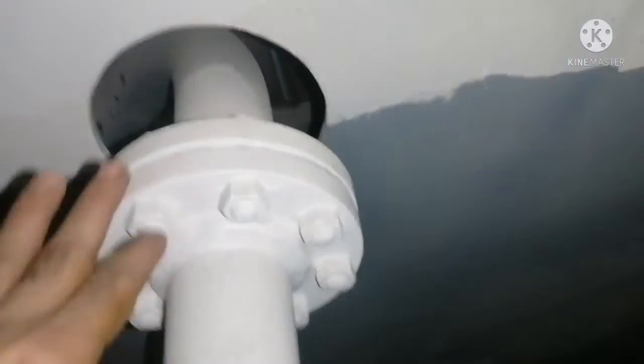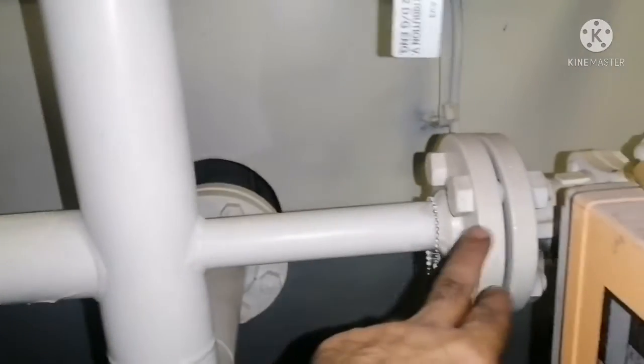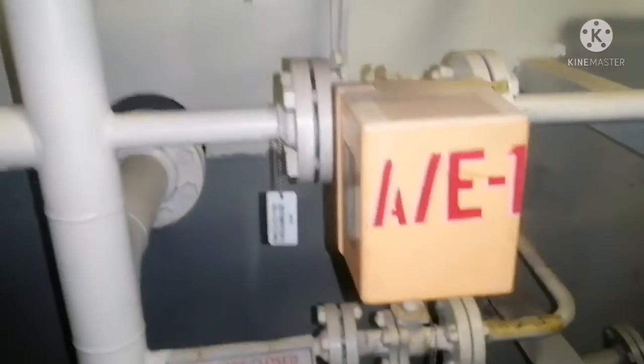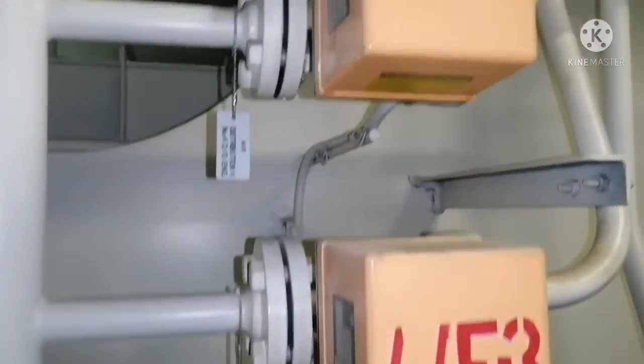You can see here the suction will be from the freshwater tank and this is your discharge line. This discharge line comes into a common manifold, and from the common manifold it has a branch — it is connected with each and every system: AE1, AE2, AE3 — and all these individual systems have automatically operated valves.